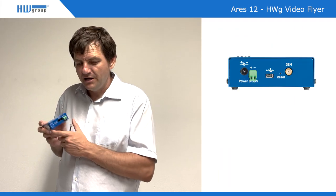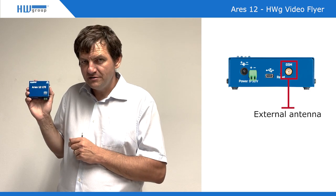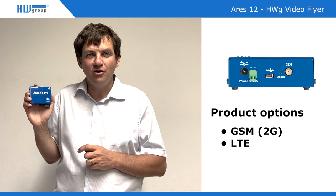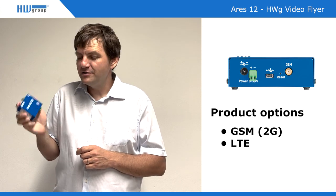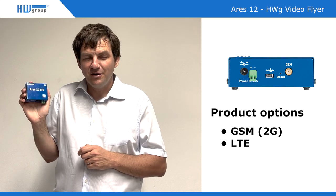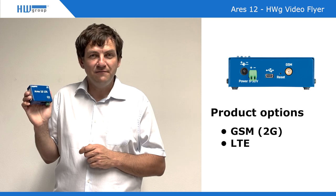As network connectivity, you plug in your own SIM card, so there is GSM or LTE available — we have it in two versions. The LTE seems to be much more stable for long-term use all around Europe. Be careful about the 2G GSM version because in most countries it will be switched off within 2025 to 2030.